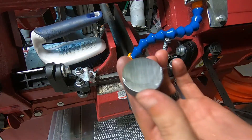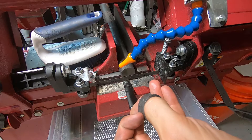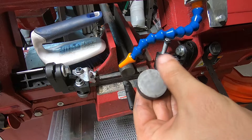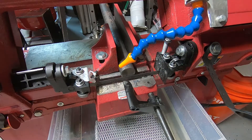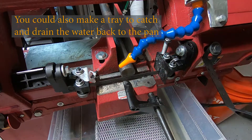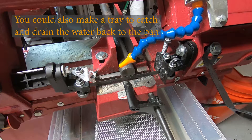Up until that very end it's a pretty clean cut. You can still feel it with your fingernail, but not bad. The other side was done with oil — overall not bad though. With this brush, I was noticing that the blade was actually carrying over a lot more water than I thought towards the back, so there's a bit of a puddle — a couple tablespoons, quarter cup at most. I can get a brass one of these, mount it in here to try and scrape off most of the water and particles so they don't end up going through the whole system.